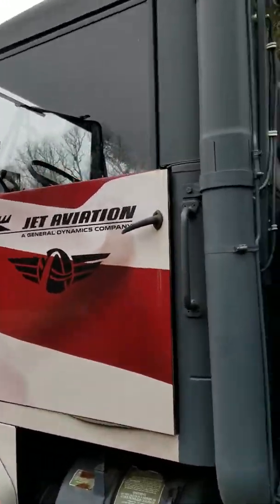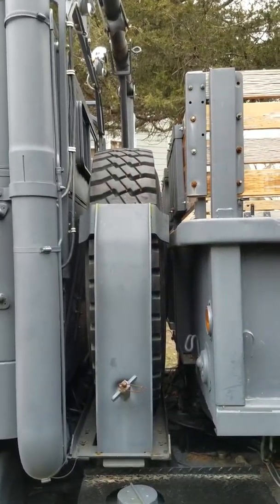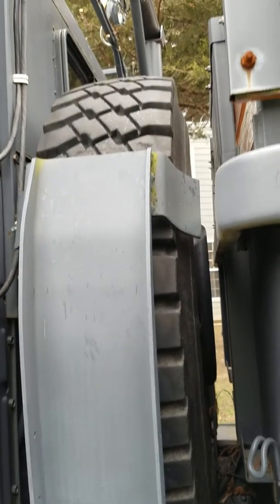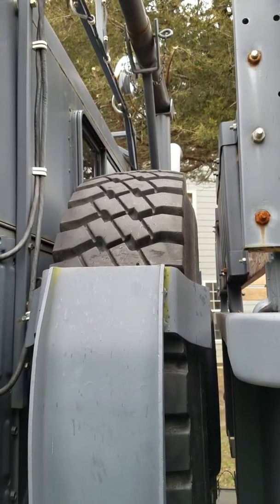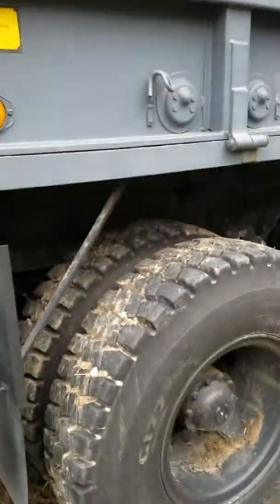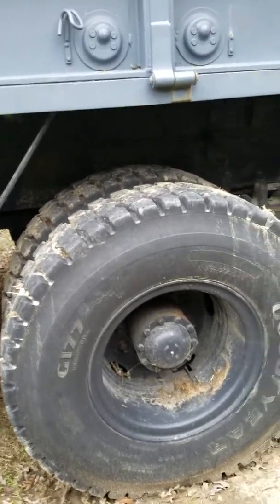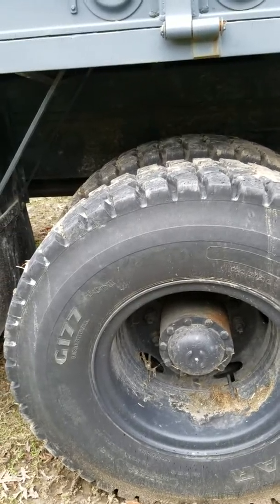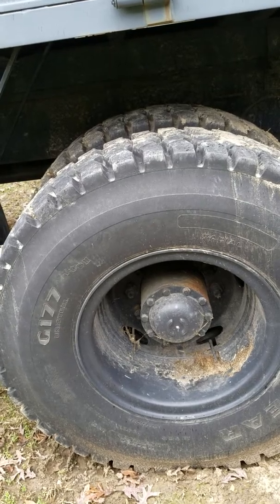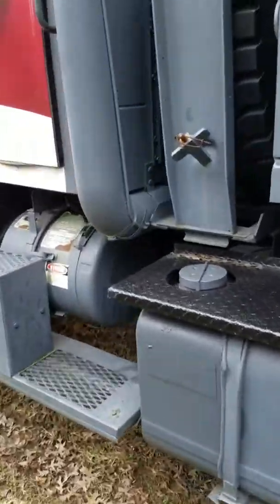Hey Wayne, Kathleen, I'm going to give you a quick rundown on the truck here. There's a spare tire — you can actually change the tire with the tools that are on board. One person can probably change the tire, offload it, go ahead and put it on. You've got a bottle jack that lifts up the rear tandem, which is nice with three axles, so you can just pick up whatever axle you need and change the tire. I've changed one out by myself and reloaded it in about 45 minutes, so it wasn't too bad.